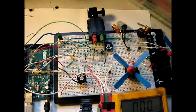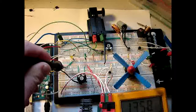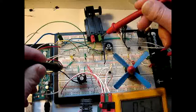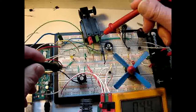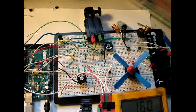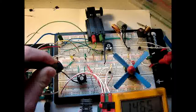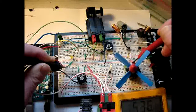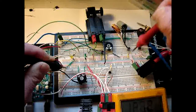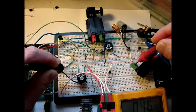And now I can measure this frequency once again, and looking at it, it says it is some bit lower, around 500 Hz, but that is still outside the range of 40 to 120 Hz. And when I look at, for instance, this motor here, it's also around half a kilohertz, 500 Hz, and for this motor it won't be much different. As you can see in the display of the multimeter, it's also some 500 Hz.